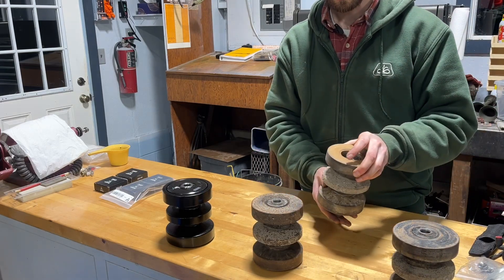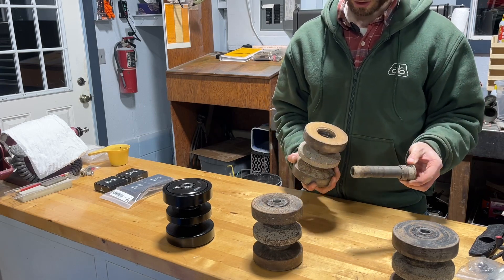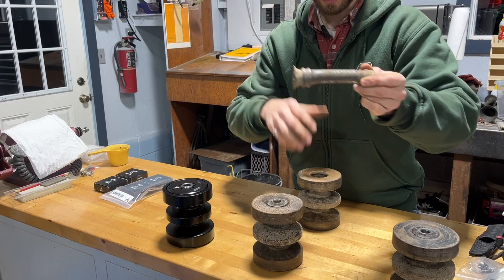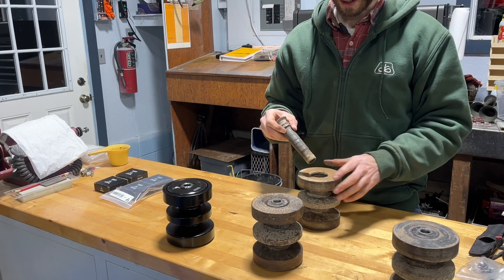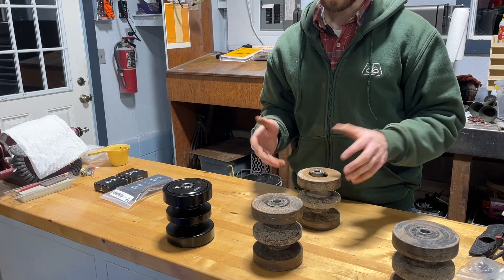This is an example of a roller that is totally shot. The bearings are totally gone. This shaft used to be totally round, and now it has kind of a step in it — that's because the outer roller was riding against this after the bearings went out. There's enough damage to this that I would not rebuild it, even if theoretically you might be able to.